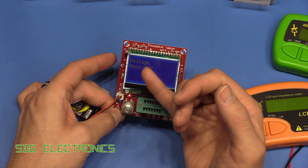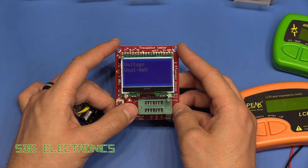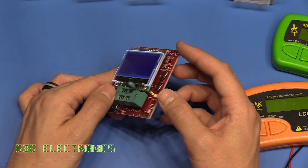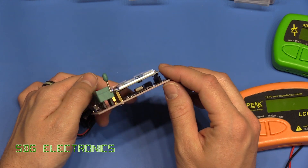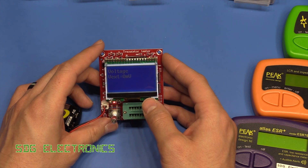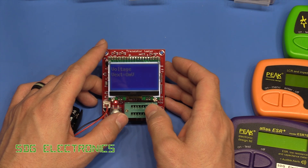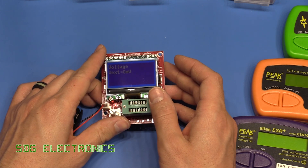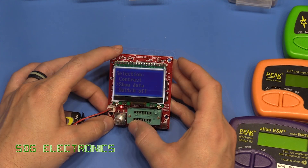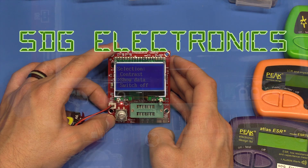You can get ones with OLED displays and all kinds of things. The only downside I'd say at the moment is we're already seeing the voltage creeping down because this LED backlight is on the moment you turn on the device. What I might do is just increase the resistor value to drop the LED current because the backlight isn't really needed. Well done if you managed to stick to the end of this video — until next time, thanks for watching.